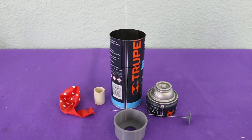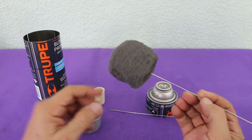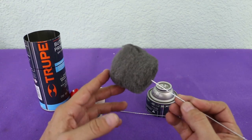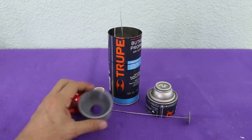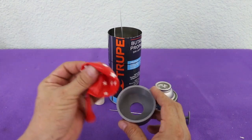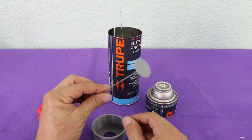Here I have the different parts to make our Stirling engine. This is the displacer piston — it is made out of steel wool using the same technique as in a previous video; the link is in the description. And this will be the power piston. Here we will put a balloon, a common balloon, and this part will be glued to the balloon.